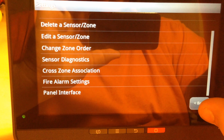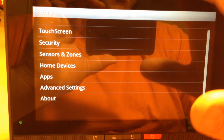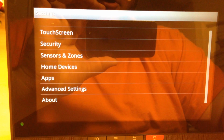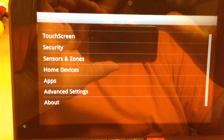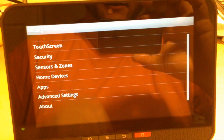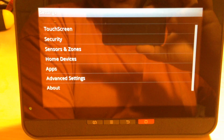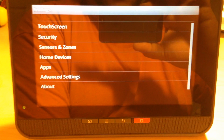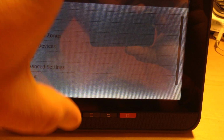What I was told also by a technician, which is very important, this system will only support up to 6 cameras. It will not support any more than 6. I guess that being said, on wireless, from what I was told by that technician, if you are running them all in wireless mode, it will only support 6. If you want to hardwire the cameras in, which is for a whole nother video if needed, you can do so, and the system should support more cameras that way.